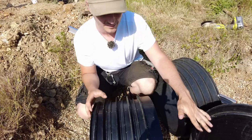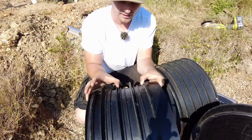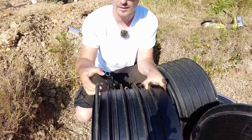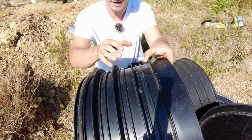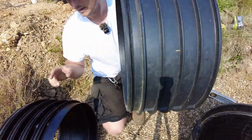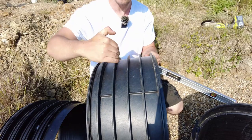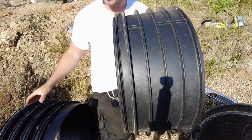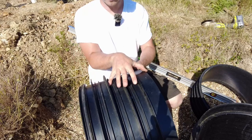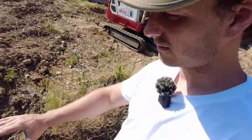This inspection chamber is a bit of a different kettle of fish. On this one, if you've got the gasket there, you need to keep the top section — you cut the bottom section off and then move this gasket up into one of these slots up here. This one's from Polydrain. With this one you keep the top and just chop the bottom section down — it's a million times better because you've got more adjustment.